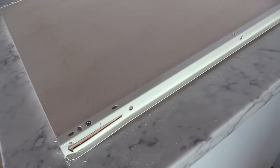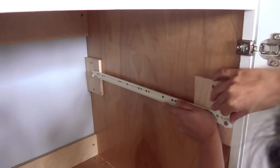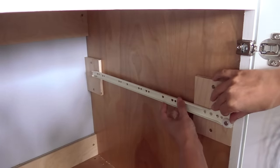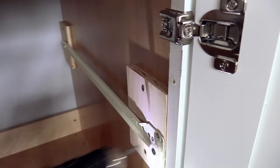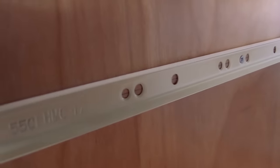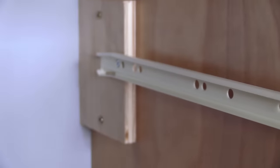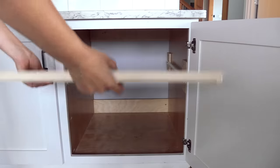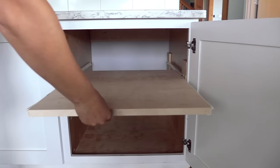What's really cool about this project is you're not wasting that shelf. If you were to buy a pull-out kit from the store, you would just be throwing your shelf away and it wouldn't be an exact fit for your cabinet. On the lines I just start my screws — it's really easy to make sure my drawer slides are level by gauging if the line is in the center of my screw holes. And on the first try, it fit perfect.